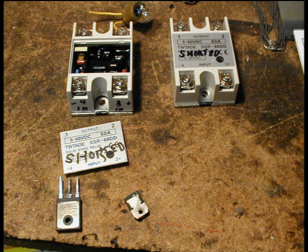That's why I spent my shop time on and off for the next several weeks working on my SSR protection device. During that time, I decided to tear down one of the failed devices to see if it could be repaired. So in this picture, you see its tiny active switching device on the right in front. Unfortunately, by the time I got the potting compound scraped off of it, I could not identify it. So I decided to repair the SSR if I could.